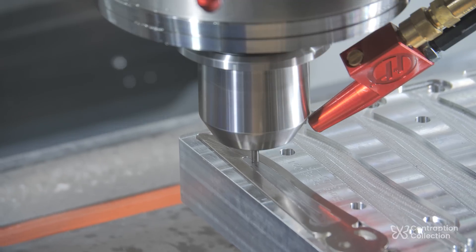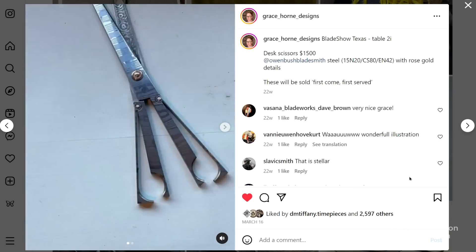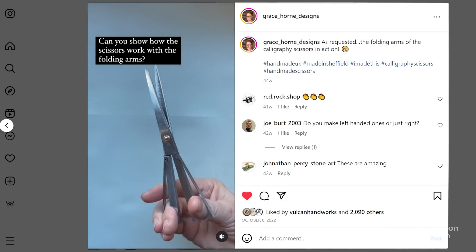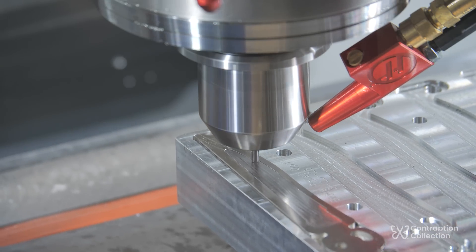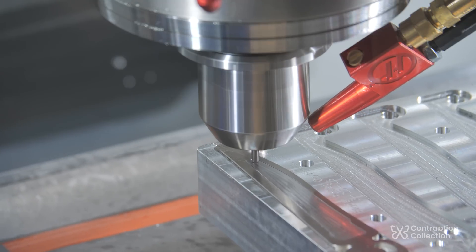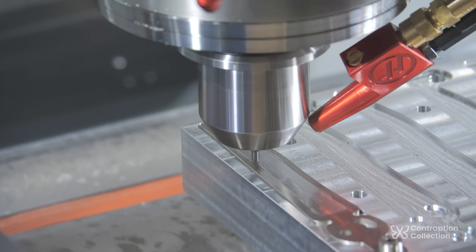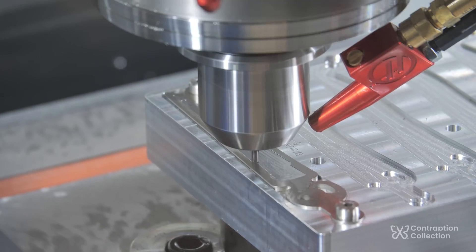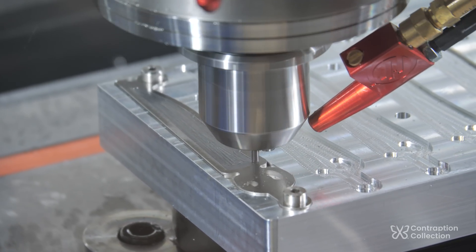After talking to Grace Horn and seeing this pair of scissors, it became clear what's actually important: the metal just needs to be out of the way. The curve doesn't necessarily matter. I don't have to go all the way to the edge, which means I can keep an outside perimeter to use as a flat reference face to fixture against. I'm keeping it simple stupid and just doing a flat area. It's functional and will hopefully make making scissors a lot easier.